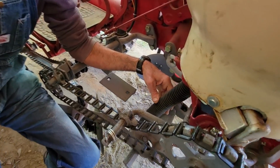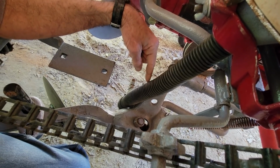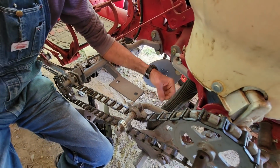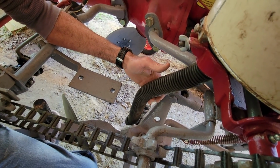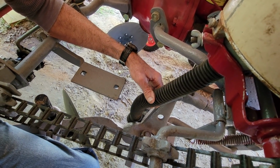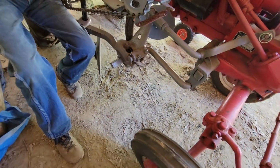Another subscriber told me that they make a long tube and a short tube for these things. The short one goes for the fertilizer, and the long tube goes back here for the planter. Well, I only had two long tubes, and I had bought this short one earlier and got aggravated because I couldn't figure out what I was going to use it for. Now I know I can use it for fertilizer. It wouldn't work for seeds because the seeds would hang up in the ribs in it.